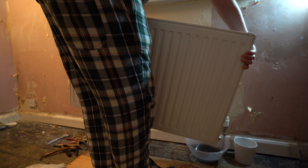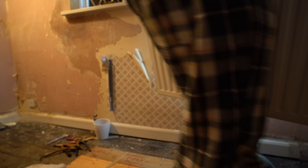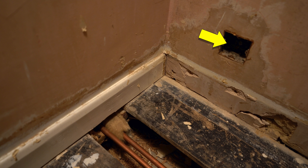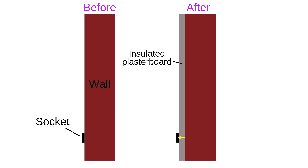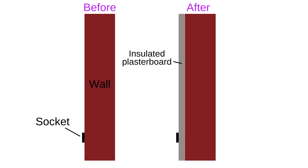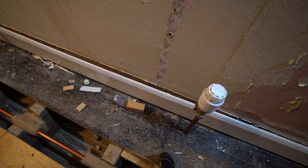Radiators do vary slightly but it should be a similar process to remove yours. I did have an aerial socket in the wall as well but when I took off the front plate there was no cable, so no issue. If you do have sockets on your outer wall they'll need to be transferred inwards, because we're adding a few centimetres of depth to the wall. If there's slack in the cable you may be able to pull it through, or you can move the socket upwards or downwards depending on whether your cables come from the floor or ceiling. It's not as complicated as it may sound and I do exactly this in my next video.